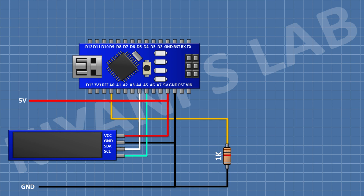After that I'm gonna connect a 10K NTC thermistor and connect its one pin to the A0 pin of Arduino and its other pin to the 5V pin of Arduino. So we have completed all the connections. Now let's upload the code to Arduino and test the project.